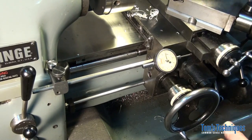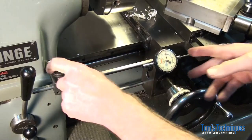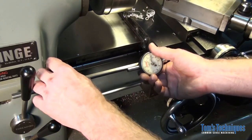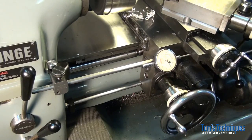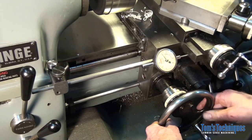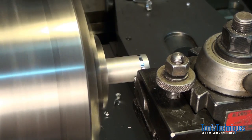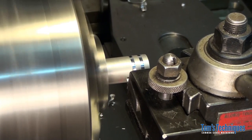Let's say we want to machine a bunch of grooves in a piece of stock — this is where the dial stop works really well. I'll just touch the end of the work with my grooving tool — I'm using a parting tool in this case. Zero out the dial. Now let's say I want to put a groove a quarter inch in — that's 250 thousandths, right there. There's one groove. Now if you want to go 250 more, all you've got to do is count two and a half more turns for another groove, right on down the part — a lot faster than a micrometer carriage stop.